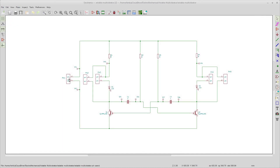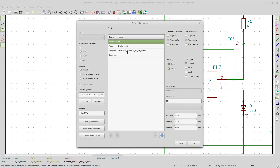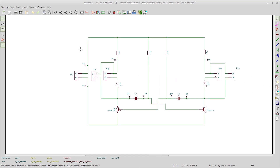Hit OK, come back here and look at this. You see that pin two is the positive, and that makes me think I really need to take this symbol right here and modify it to where I have a positive and negative symbol on here, so it correlates with that. You can actually go ahead and permanently associate the one with the other so that every time I use this, it will associate with that particular footprint.